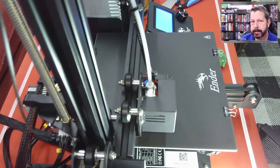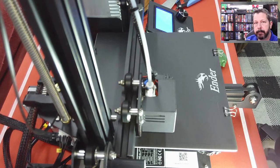That's usually not so much a PLA problem or even a PETG problem. It's usually more of an ABS problem, or maybe a specific geometry problem. So you've got a part that just keeps wanting to peel up, or maybe it's got really low surface area and it just doesn't have a lot to stick on here. So in those geometry problems, there is an option.